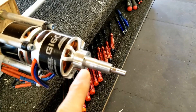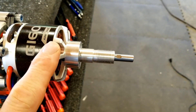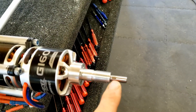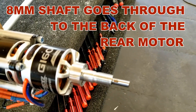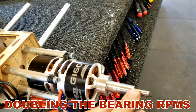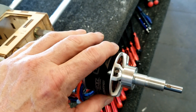Right here is the piece I was talking about earlier — that is the new nose piece, very similar to what comes on the motor. It bolts right on to the housing here. You clear out this housing, and then the bearings are in the back end of this unit and the front end of this unit — a 15 millimeter and a 12 millimeter with an 8 millimeter shaft running through between. I use ceramic bearings from Acer. It's about a little over an inch and a half front to back, almost an inch and five-eighths, and that gave enough stability because that's really what the whole bell — the can of the motor — is running on.